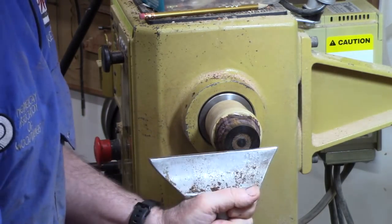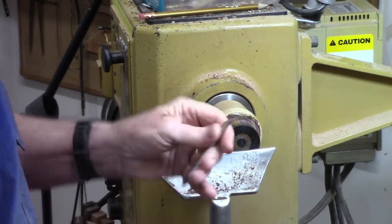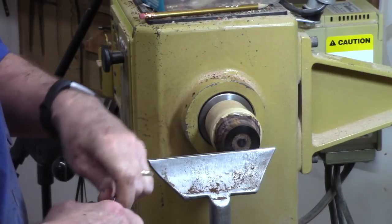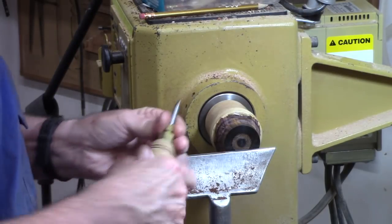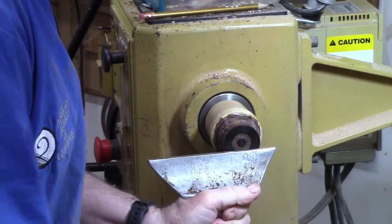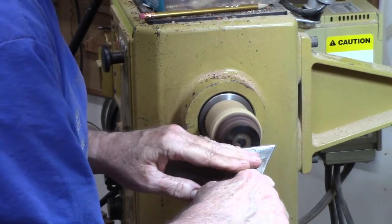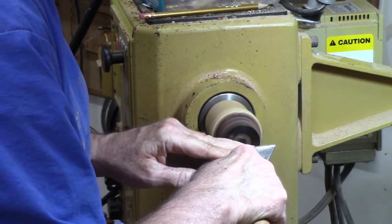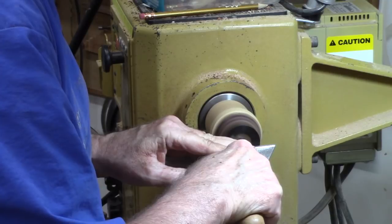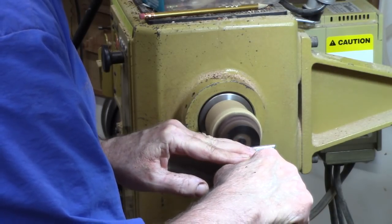I sand up to 400, cut a slight contour groove, and use my Dremel decorating burr to put in a little texture — I have to turn the tool rest around backwards to get in there. Then I rearrange and change out the tip to a point tool so I can frame the texturing by putting in a few beads or V-grooves around the texturing on the inside and outside. I turn the speed down for texturing and back up for scraping with the point tool.